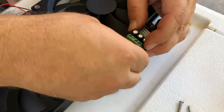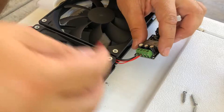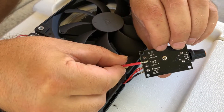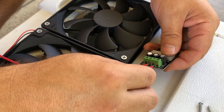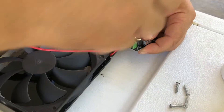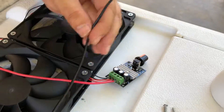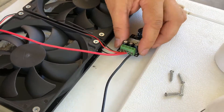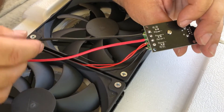Now we're doing the positive from both fans going into the motor positive. This is the power coming off the battery — connect it to the power positive, get it into the slot, and secure it with your Phillips screwdriver. Then get the negative from the battery and put it into the power negative. Get them all secured and make sure the wires are not touching each other so you don't have any shorts.